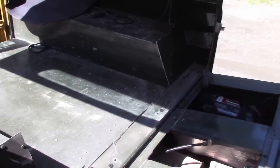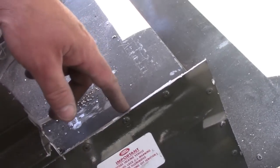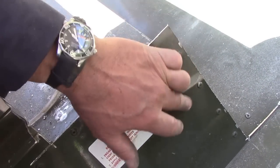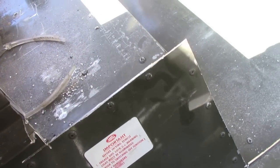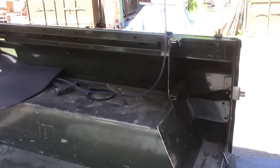I'm not sure — there's a nasty little rivet up there we've got to knock out, and we've got to cut across there, which is going to be quite difficult to do with the grinder. Anyway, look at all that room though — that's going to be brilliant. You can probably see my idea why I don't like this paddle here. What I'm going to do is cut some angles and pop rivet them on the inside and then take these bits off. That's going to be a lot better and it'll look more aesthetic than this great big flange sticking up — that's just lazy. But we'll continue and cut off these other bits.